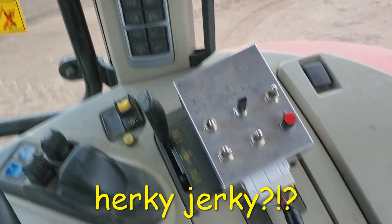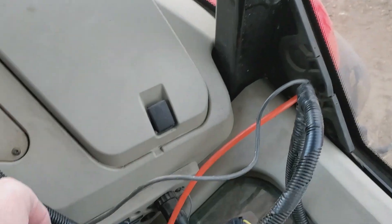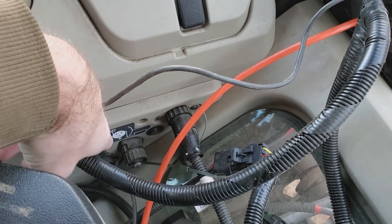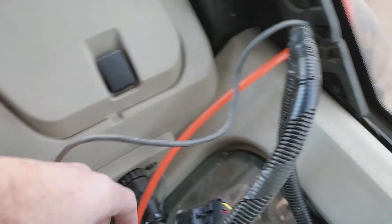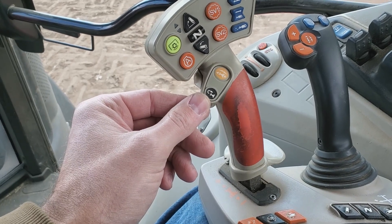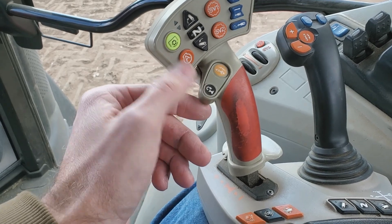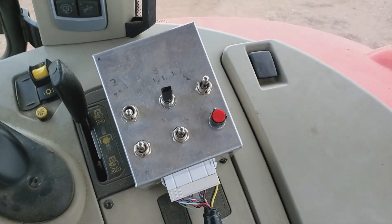It's kind of a revision to the thing I made. This tractor is also handy in that through this harness it has what's called a headland management switch. By doing that I can, from the tractor's headland management button, turn on and off a relay. So what I did with that is I made it so that from this little button here I can turn on and off the bale loader, same as if I did it here on the control box — and I'll show that in a little while.